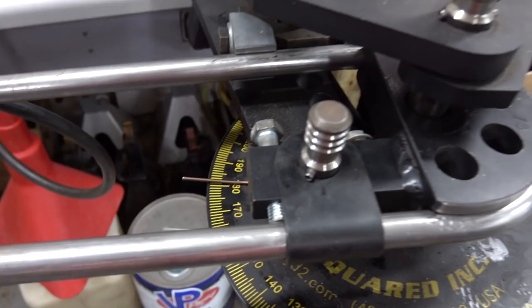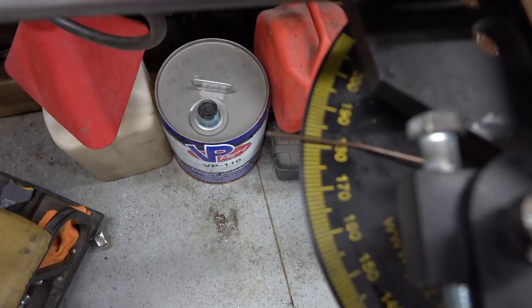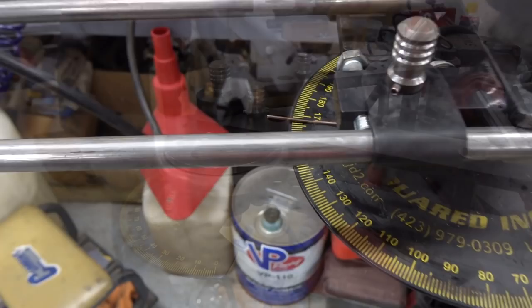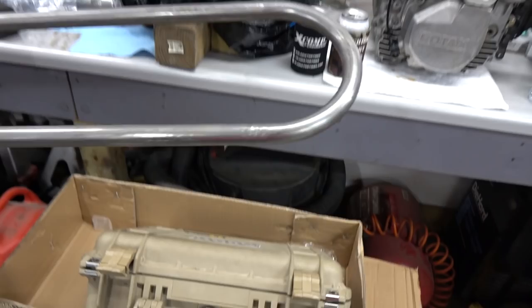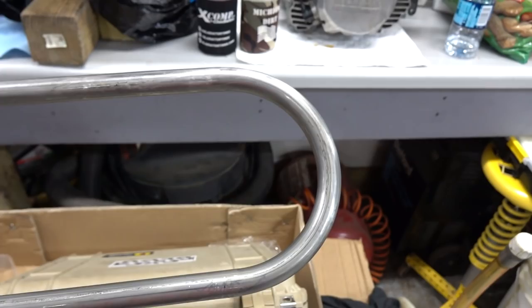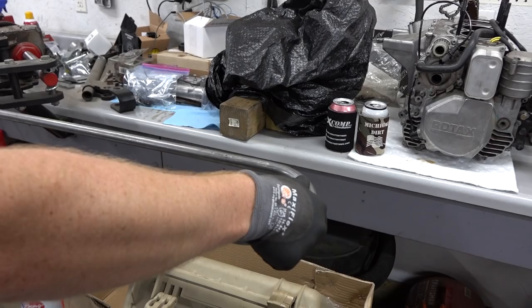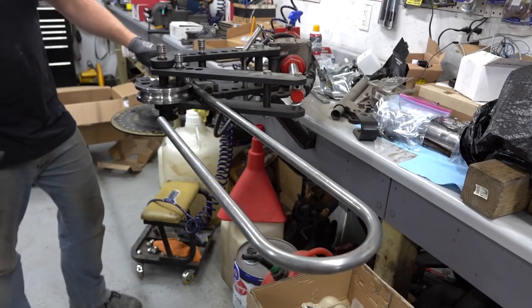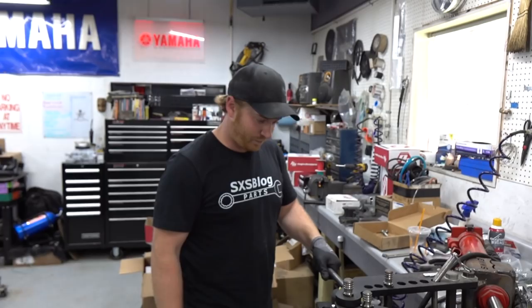If you look down the pipes they're a little bit closer than parallel, so hopefully they spring back just a bit. There's a lot of spring back — about 12 to 13 degrees. Looks beautiful, basically no pinch marks anywhere on that thing. That's going to work out really well. We're going to repeat the same thing about 36 inches down — that should be really cool. We can bring it down here, level it out, and bring it around the same way.